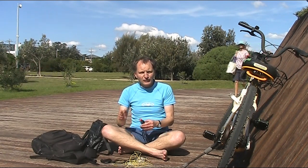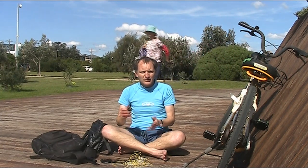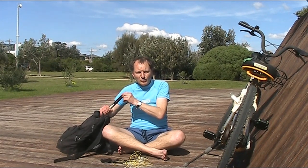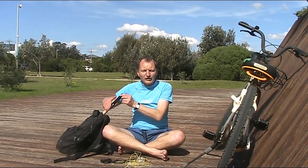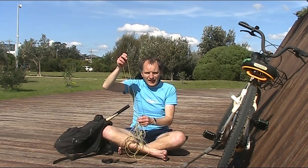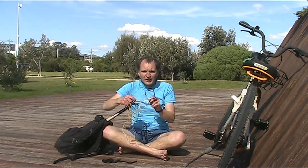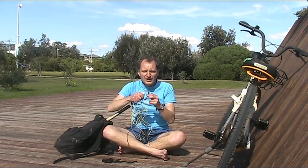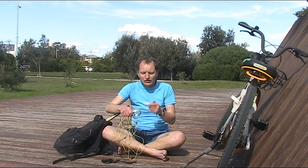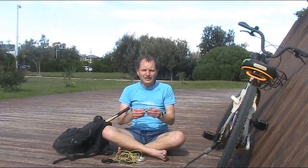You've probably seen my previous video on the Wadetenna, a pedestrian mobile antenna that I can use on frequencies from 7 through to 50 megahertz. I use it pedestrian mobile, normally walking in the water. I've got a backpack and this telescopic squid pole antenna that I have the radiating element strung along it. Then around my ankle, I have this aluminium ring that keeps it in salt water, which improves performance, particularly on lower HF bands. The Wadetenna DX is very similar, but it doesn't do quite as many bands.